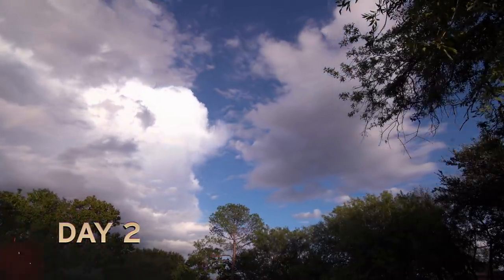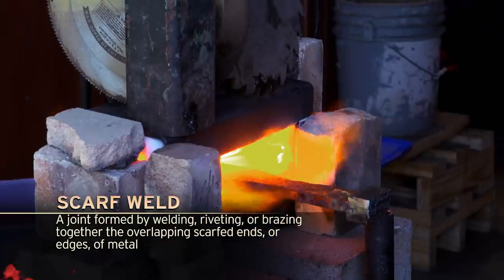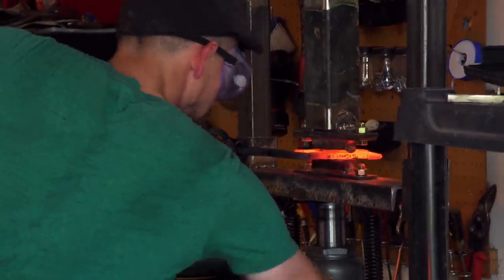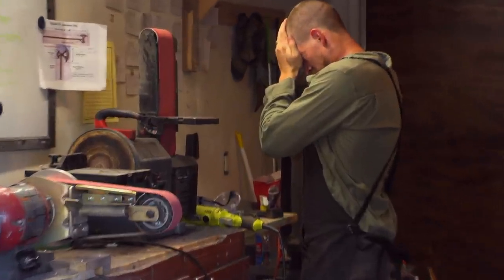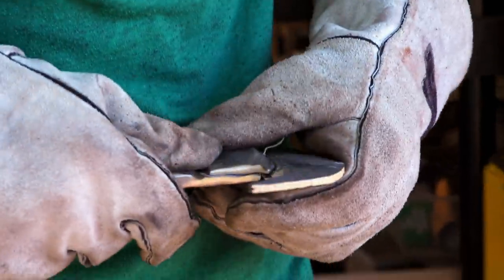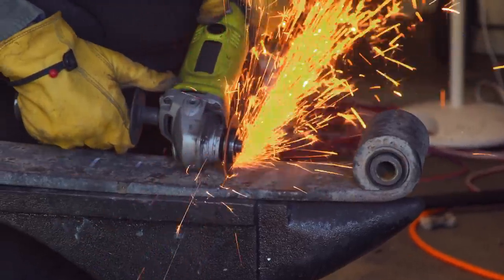I feel like today's going to be a good day. I'm going to go ahead and clean up the piece. I'm going to set all my weld lines with the welder and create a scarf weld so I can bring out more of the head of the axe. I'm going to draw it out a little bit both ways and see how well they stuck. I start noticing cracks — my welds aren't welded up, and I see I've only got one and a half inches of steel left. My blade broke. It shattered. The forge welds never stuck. The original piece was all that held on. I've got to start over. I've got to find something to turn in. I've got plenty of time to at least turn in something ugly. So I've got some spring steel, and we're going to go from there.